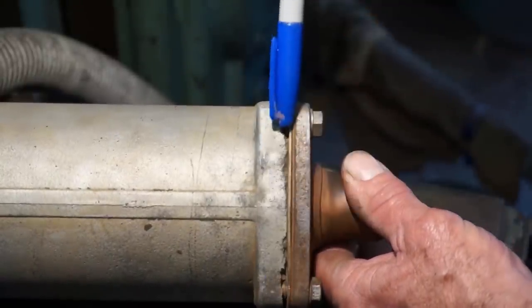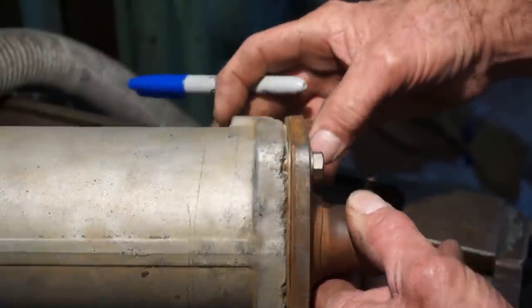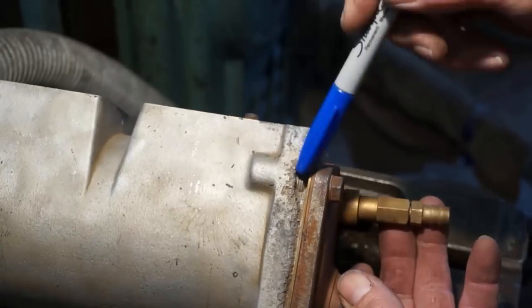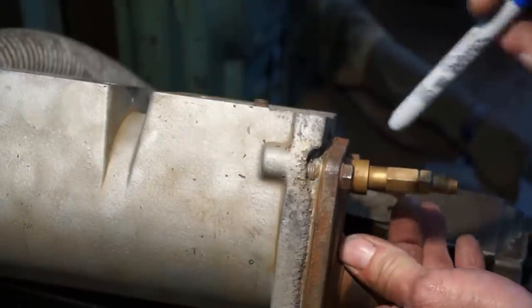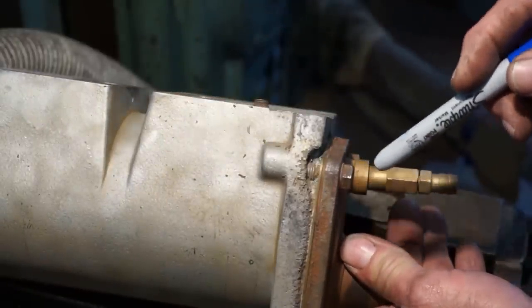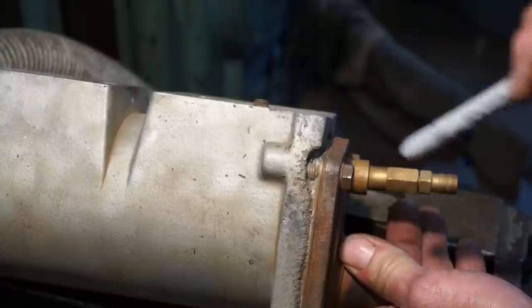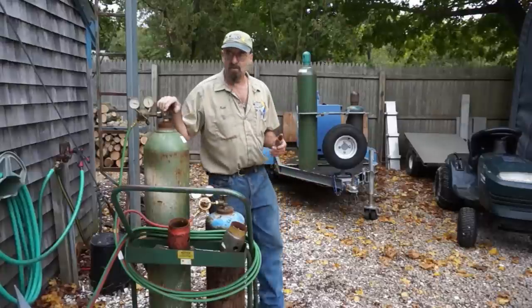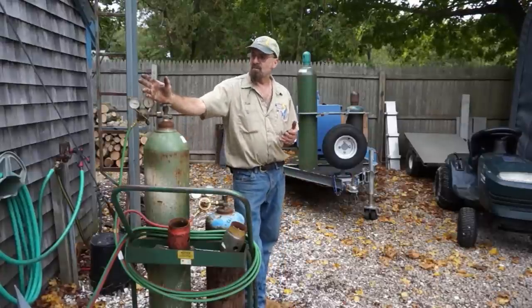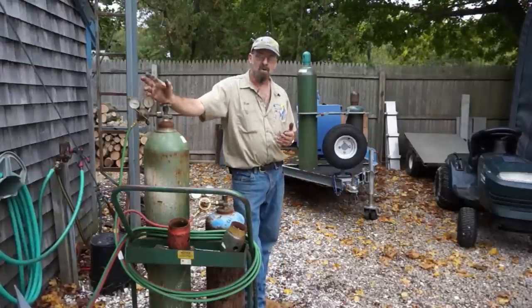You can see how much is eaten out in those areas there. But that first side we were looking at was the worst right there. Alright, let's take this and clamp it in a vise, and we're going to apply a little heat and tweak. We're going to heat here, and tweak on the nut here, or the head of the bolt.